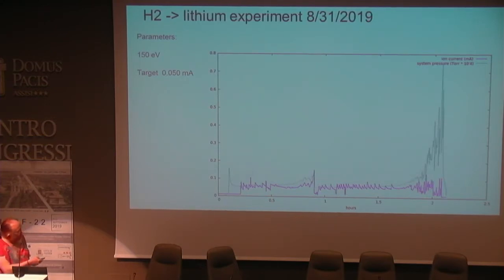As for the behavior that I saw as I was running this, I will say as a convenience and being nice to my equipment, I was running my backing pump in its low speed because it was keeping up with the system pressure, and there was no apparent benefit. And then I saw this happening. My system pressure is going up, my current is going up with it. I turned my backing pump back up to its full speed, continued on, and then it started doing the same thing.